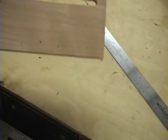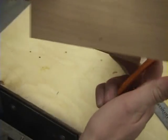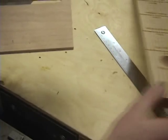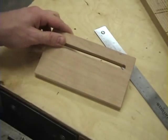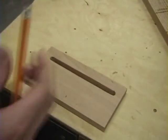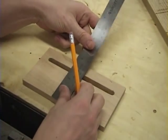All right, now how high up should they be? Well, the board that they're going to get attached to is 3/4. So I'm going to go half of that. Half of 3/4 is 3/8. Just double the bottom number there. All right, so I'm going to go up 3/8 of an inch on both of those